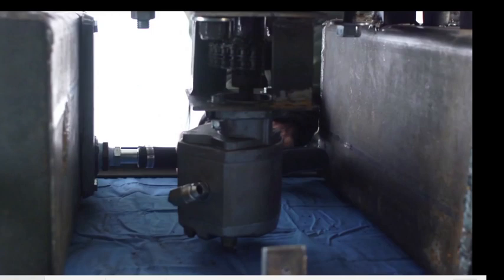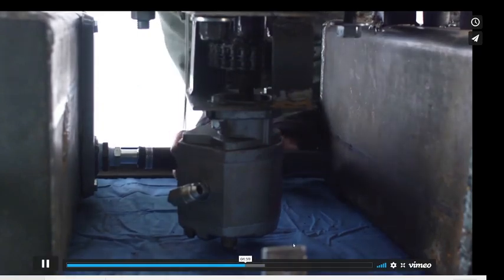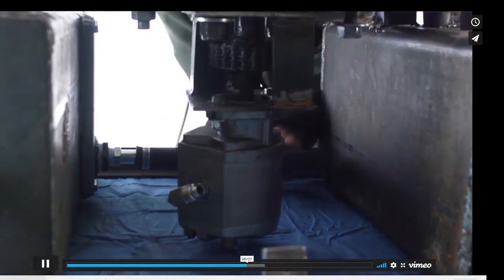We're doing a double chain coupler, so we have a lot of tolerance in terms of alignment, so anyone can build this. Otherwise you've got to be very precise, like when you mount it, it has to be exactly at right angles, otherwise it will bind up, wear and break. So this way, pretty much a novice welder can make your engine pump, and if it's a few degrees off, it doesn't matter, because the chain coupler can move a few degrees to account for inaccuracies. Yeah, that seems like a good replacement for all of the hubs. Yeah, that is a good way.